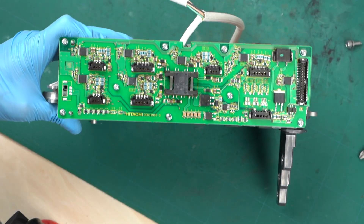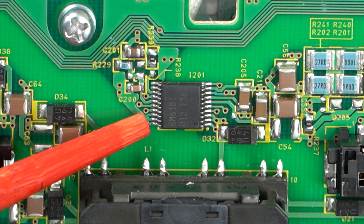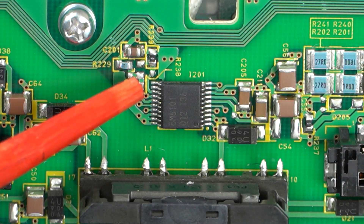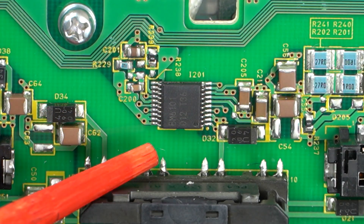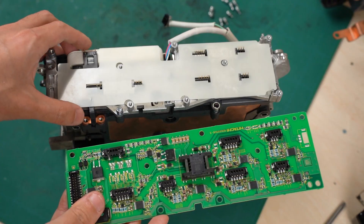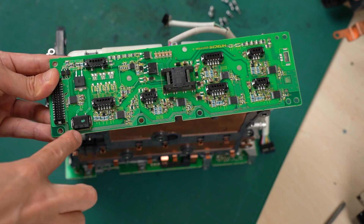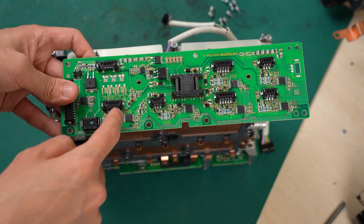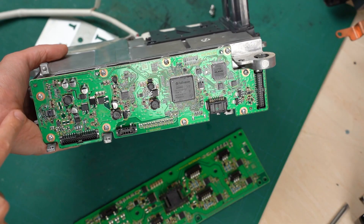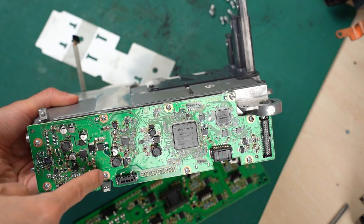Let's have a look at the gate driver board on the other side. A total of six gate driver ICs are used here. The isolated gate driver ICs are BM610, made by ROHM. ROHM is recently known for power semiconductors and gate driver ICs, but their products were already used for various products back then. I'd like Japanese manufacturers like ROHM to grow even stronger. On this gate driver board, the potential rises to the battery voltage, so an insulating sheet is attached. Ground fill is not applied here because zero volts and 400 volts exist on the same circuit board — that's the big difference from the control board, which uses ground fill and is attached to the frame.